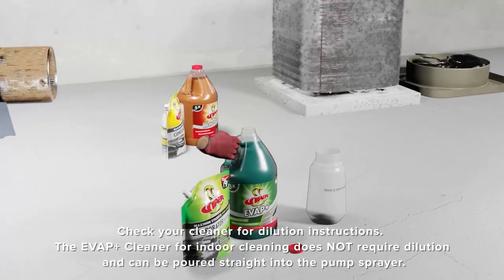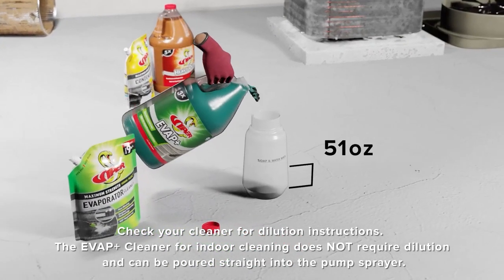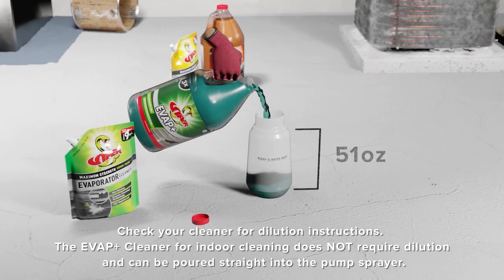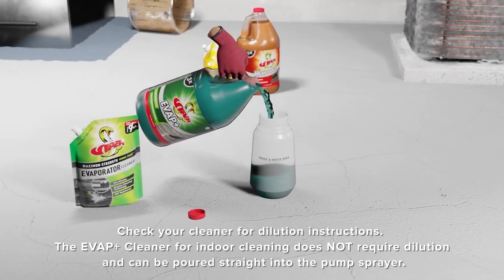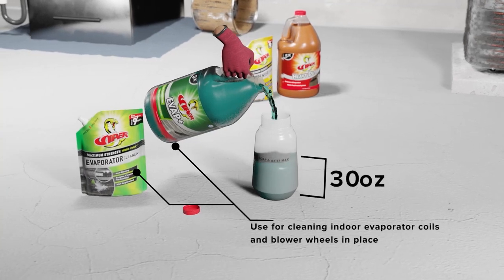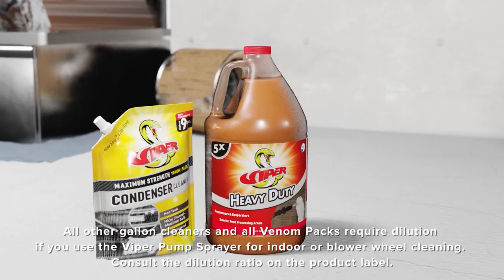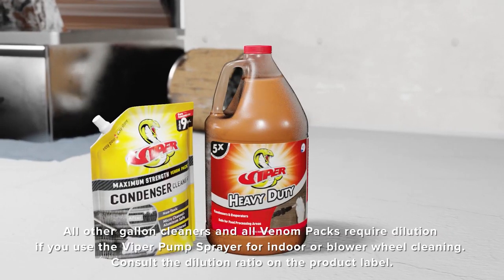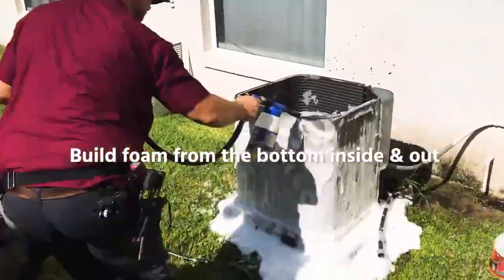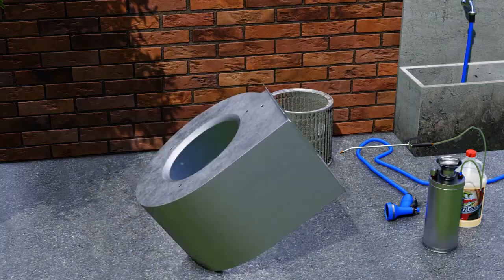Within the Refrigeration Technology's Viper line, we have the standard gallon jugs as well as the more concentrated Venom Packs. EVAP Plus and the evaporator coil Venom Pack are specifically designed for cleaning evaporator coils, as well as inside the cabinet with the components still in place. The condenser coil Venom Pack and Viper Heavy Duty are designed for more intensive outdoor cleaning, specifically condenser coils, but we also use them with blower wheels that we've pulled out for cleaning.